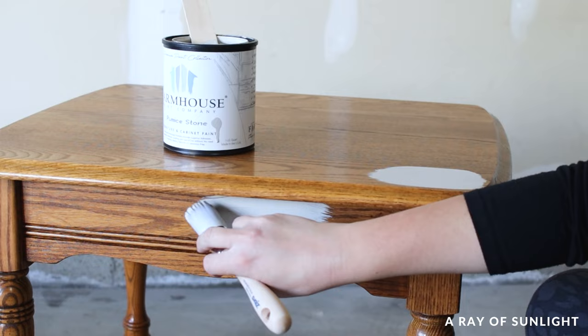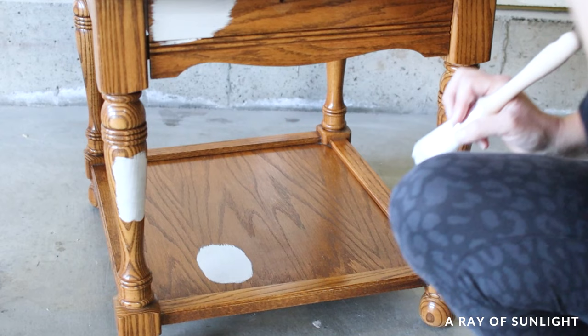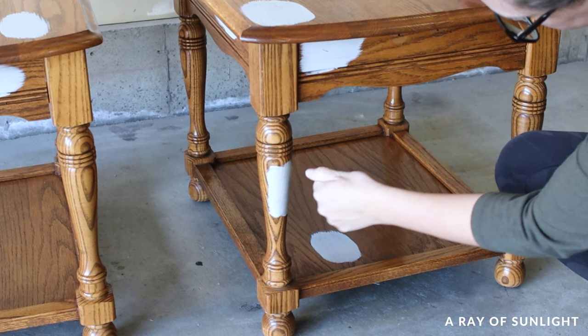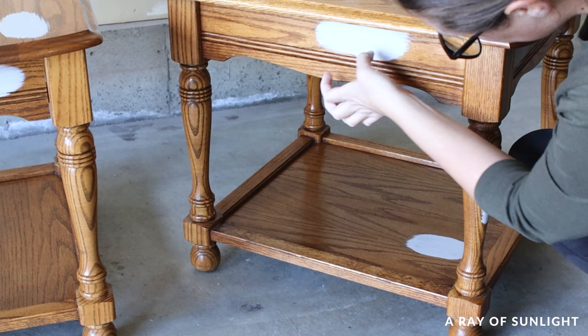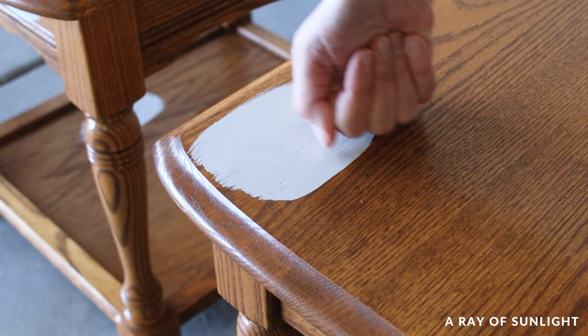So I like to test it all over just to make sure it will work on the whole entire piece. If you're nervous about your paint sticking without sanding, you can paint a couple of samples to test it out before you paint everything. We let the samples dry overnight — about 17 hours — and then I scratched at it with my fingernail. Typically, if the paint comes off easily when I scratch at it after 24 hours, then I don't trust it to stick well enough without sanding or priming. This paint scratched a little tiny bit, but I had to dig into it to get it to scratch. So I completely trust that it's going to stick, especially after it cures in a month.